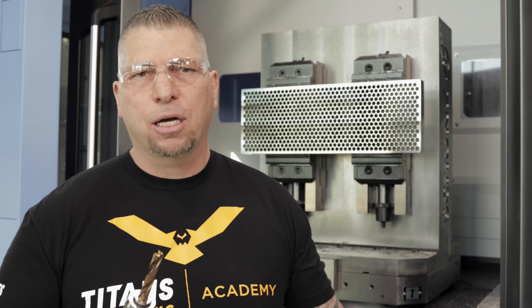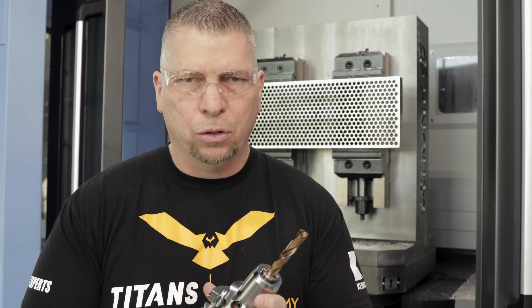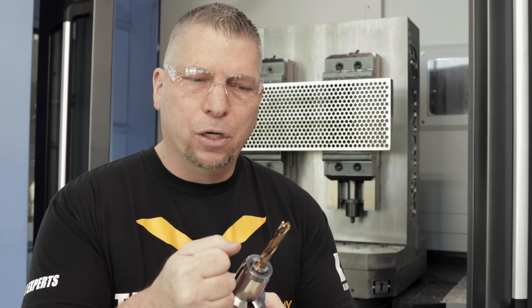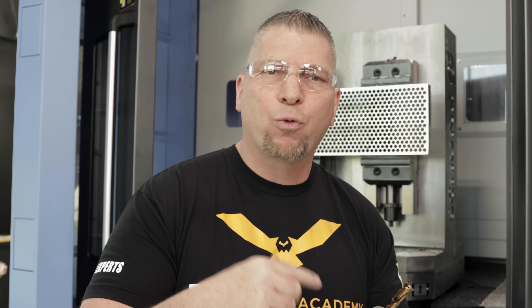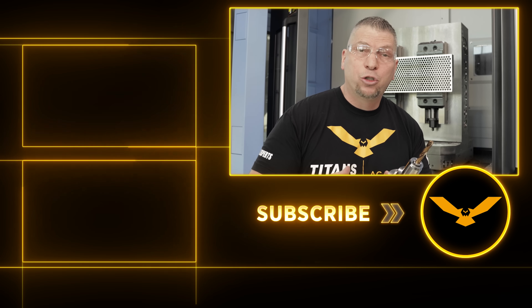To end this video, I just want to touch on a couple things. We ran Synergy 735 coolant through the spindle on this HPR drill. We have a HydroForce holder with a sleeve locking the drill in place so the coolant can only come out through the coolant holes. When you look at a half-inch diameter hole, Kennametal recommends 430 to 690 surface foot — in this particular test, we went at 610. For feed per rev, Kennametal recommends 13 to 20 thousandths for the half-inch drill; we went at 22 thousandths just to show you that it's possible. If you have not subscribed to our channel, please subscribe, hit that like button, and put your comments down below because we do answer them.